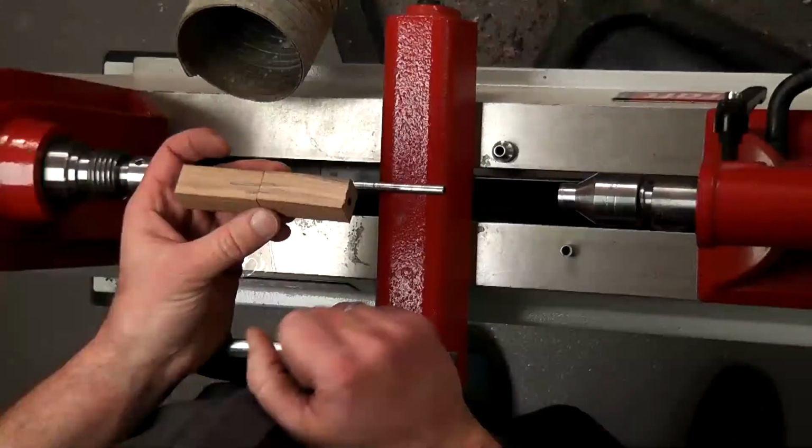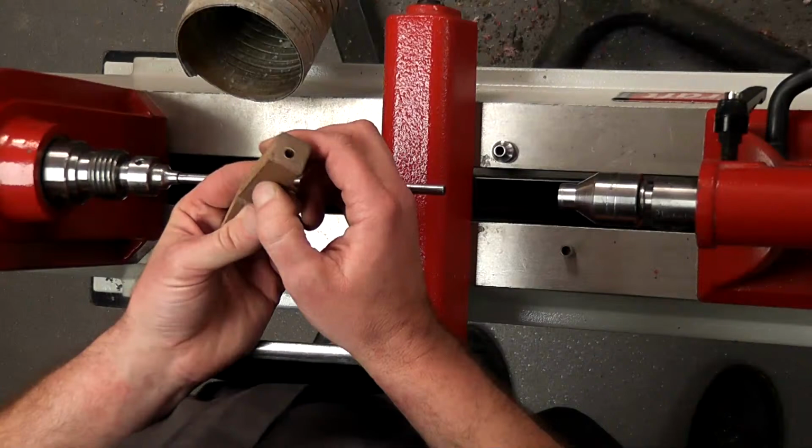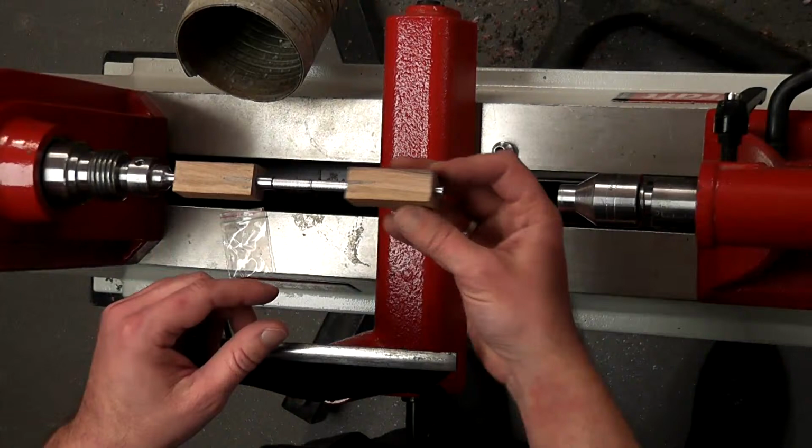So we're back to our pen blank, sorry. We've glued those in. We've trimmed the edge ends, and I did that with a sander. I cheated, and I've always done it like that. Those barrel trimmers come in useful when the drilling goes a bit wrong. They can get you out of a sticky situation, instead of offering these up at an awkward angle to the sanding table or the sanding disc.